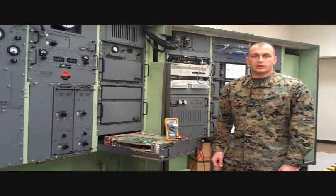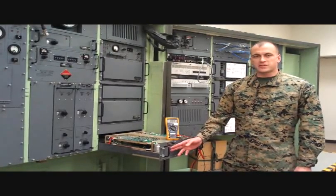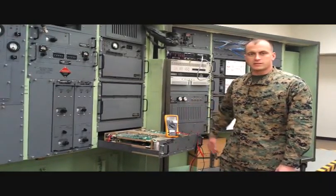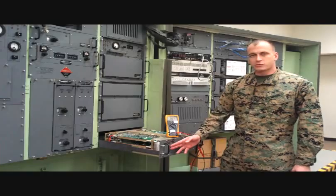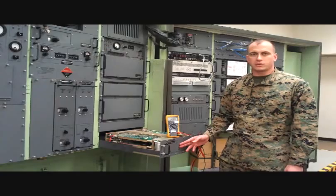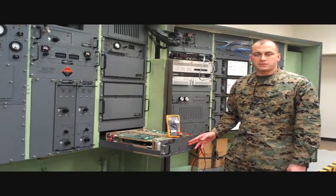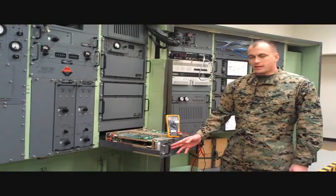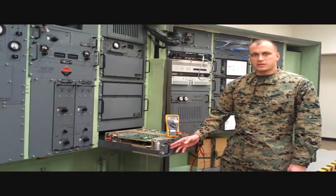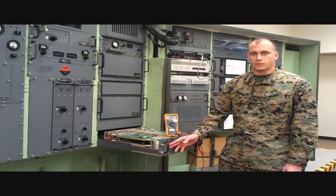Today's alignment is going to be performed on the 5.3 volt CCA located in the 4A3. This alignment can also be performed on the other CCAs in the 4A3 as well as the CCAs in the 5A6, since they are similar in design. One special note: the negative 5.3 volt and the positive 5.3 volt CCAs are identical with the exception of output polarity, and the same applies to the negative and positive 15 volt CCAs. When testing the output of a CCA with a negative voltage using the front panel, you're actually going to be reading a positive voltage, even though the card outputs a negative voltage.